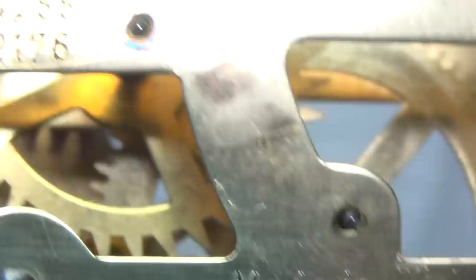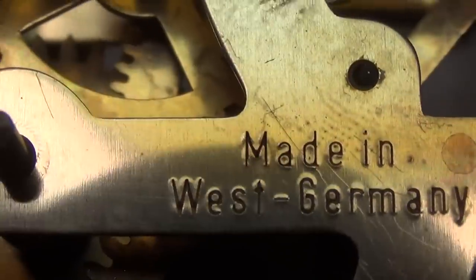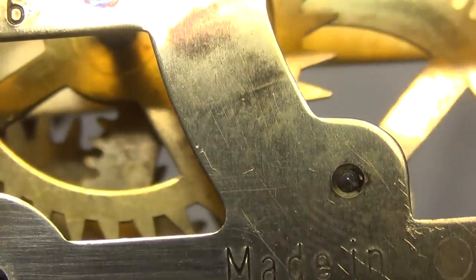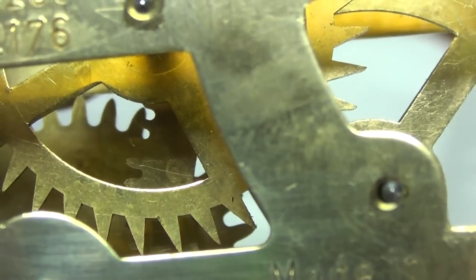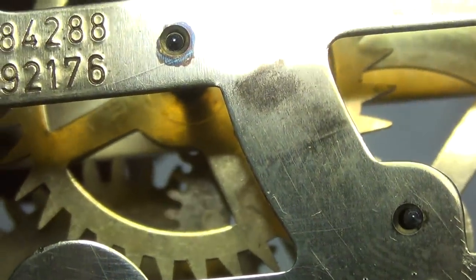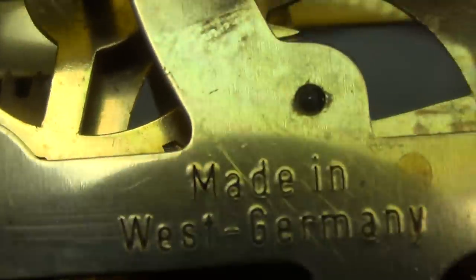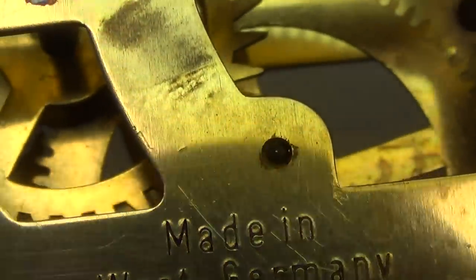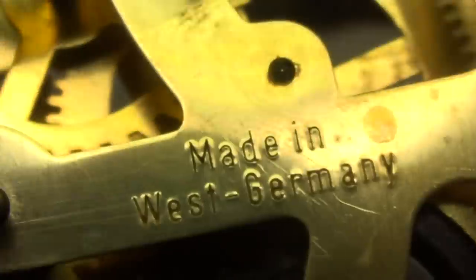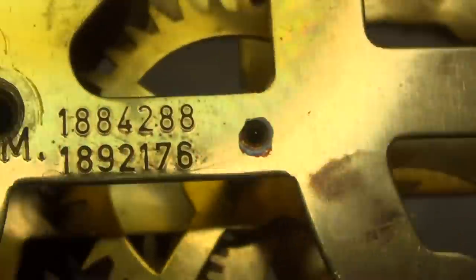Okay, I put the three wheels in on the run side, and on the back plate we look at the second wheel. Definitely needs replaced, and you can see on this thing where it's worn. It's worn there. See the cup? So we're going to mark that as being rebushed. And we see that that's the unworn side, so we're going to have to file out that side.